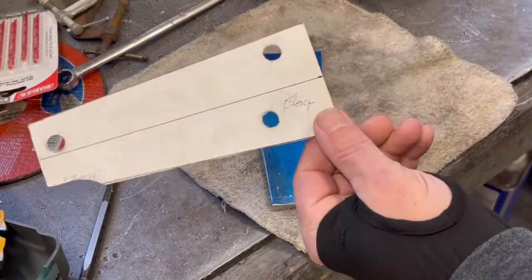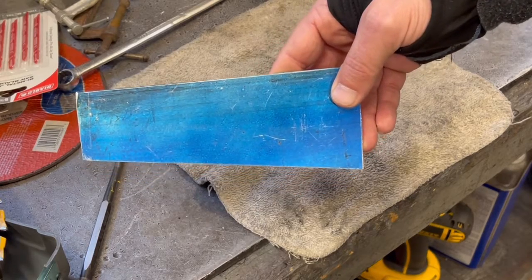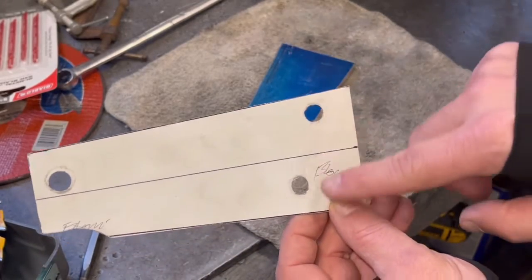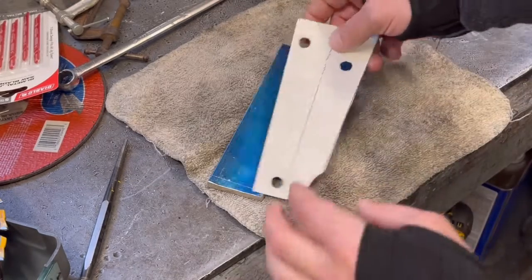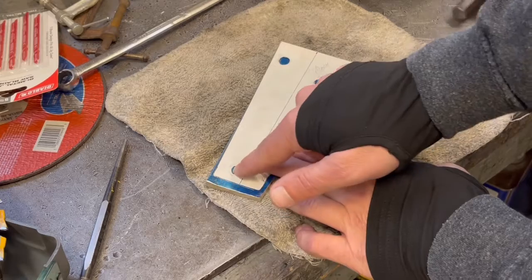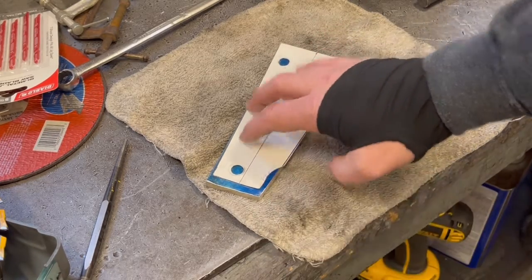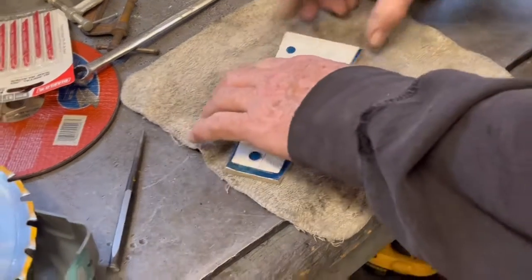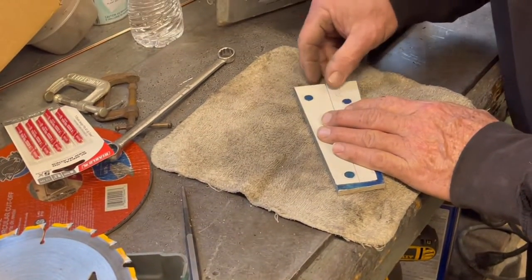So here's the cardboard template, and we've got both of them roughed in pretty good, chucked them up in the mill, got them straight. What Jimmy's going to do now is — when we originally put this on the engine block, he used transfer punches to mark where the bolt holes are going on the front of the engine block. So now he's going to line this up perfectly straight, transfer those yet again, and then we can get those drilled, make sure it's in place, and get these brackets pushed up. The next stage of this process is getting the holes drilled.